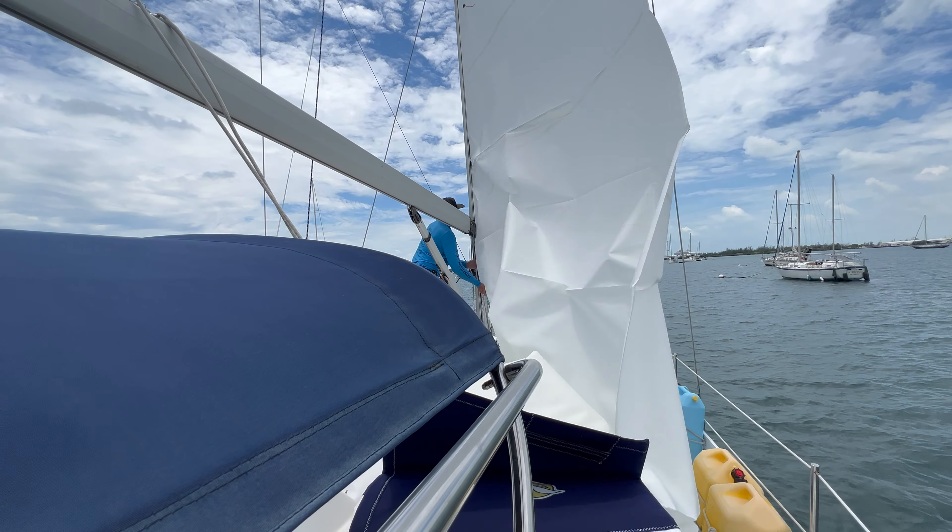The rigger Kurt is helping us feed the mainsail in while Matt is pulling the mainsail up, and I'm just taking out the slack in the mainsheet. To get the right tension on the halyard, you tap the luff a little bit, and when it starts sounding like a drum you're in the ballpark.